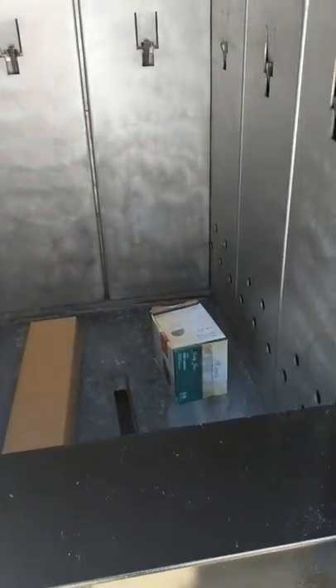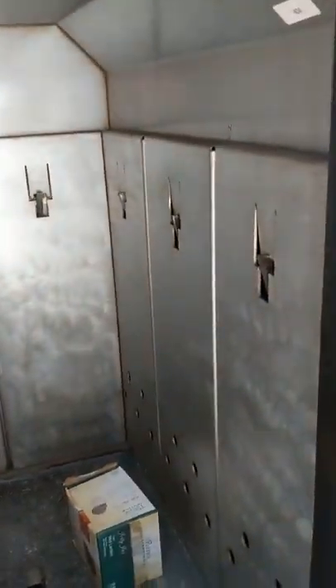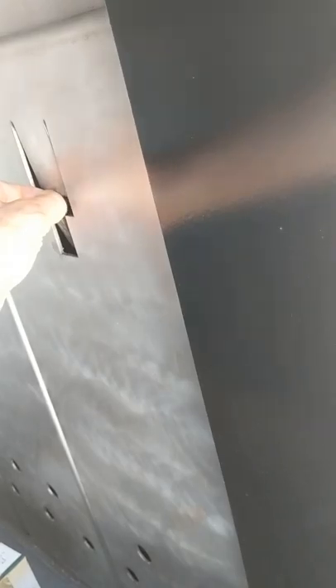I really like this design. I really like these panels — these are 10-gauge stainless panels. They all sit on a separate hook, not intruding with the firebox overall design, not putting any stress on the firebox walls. Some manufacturers have rails welded top and bottom — I don't like that design. I really like this simple single-hook design for each curtain.